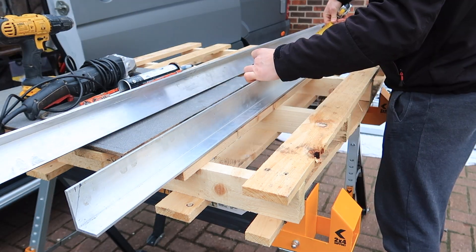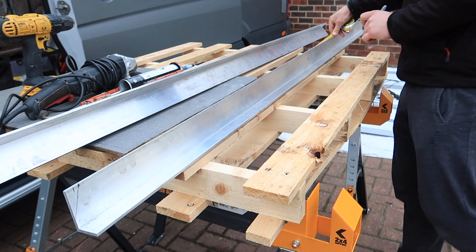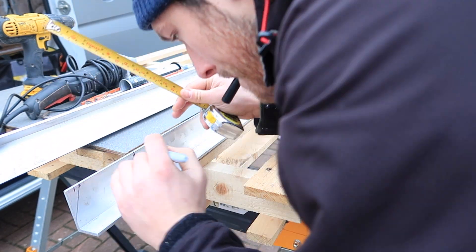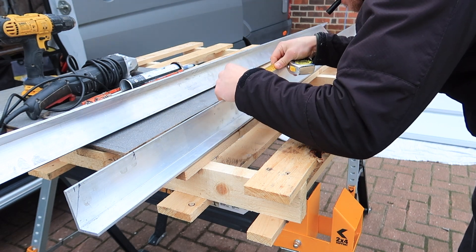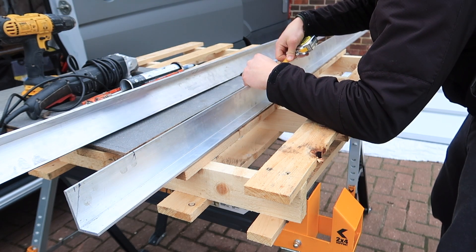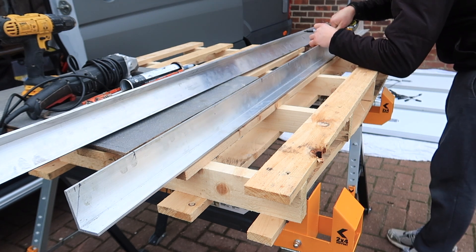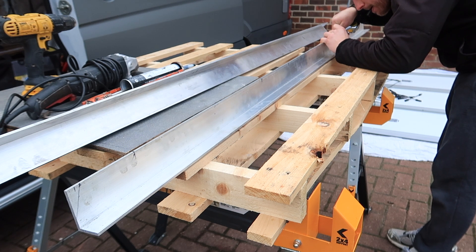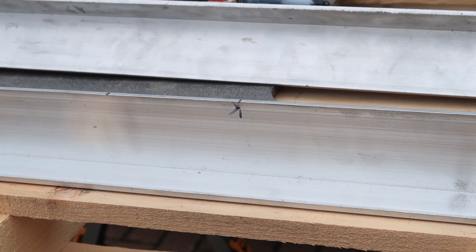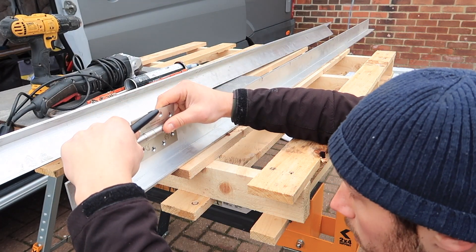I marked from the 20 millimeters at the front the width of one panel, then measured in 100 millimeters from those width marks — this is where I decided to position the hinges that will be attached to the solar panel framework. I put a little arrow on the line so that the outside of the line is indicated; the hinges will sit to the inside of that mark, opposite side of where the arrow is.